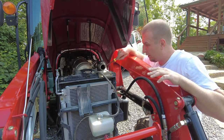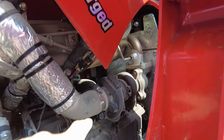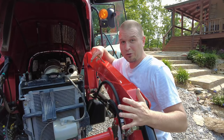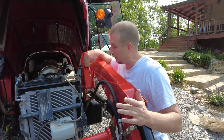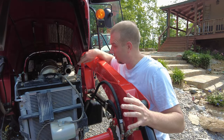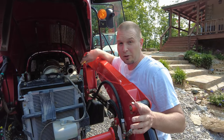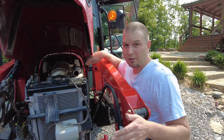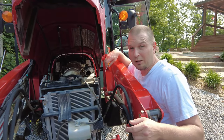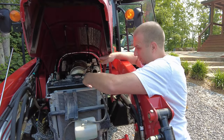This tube goes right to your intake, right to your turbocharger. What we just took off was the air filter — the filter that cleans all the air going through this tube. So we're not going to use any compressed air on this until the air cleaner is connected back up, or you plug this hole with an old rag to prevent debris getting into that turbocharger. If it gets in the engine, it'll do more damage than just the turbo.